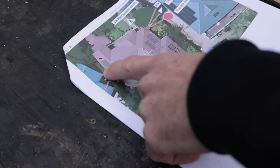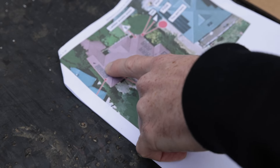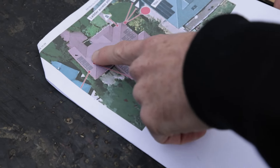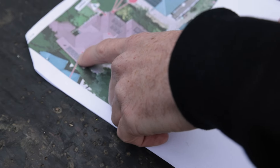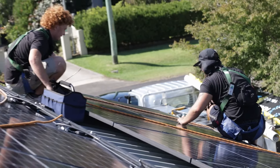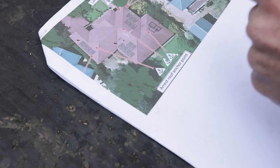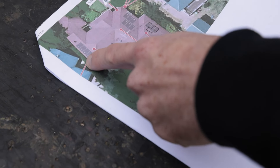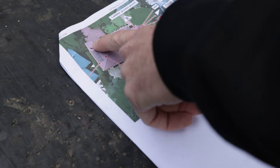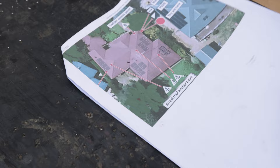With this particular job we've also got a two-story drop on this side of the roof. The best thing about portrait is that at the end of the job, when everything's completed, we don't have to go and fix our ends like you would in landscape. In landscape, the way we hold our panels is with ends flipped the other way to hold them in place while we get everything level and straight. At the end of the day, the boys roped up would have to walk and flip every one of those ends — and if you can't get ladder access it's quite tight, and even though you're roped up it'd still be quite dangerous. With portrait, the ends are at one side and the other, and once the panels are laid the job looks good and it's done. No need to flip ends or anything unsafe.